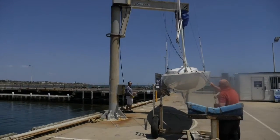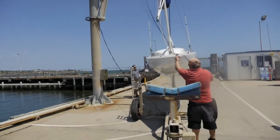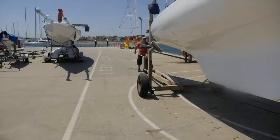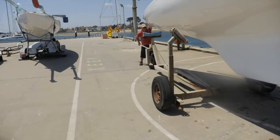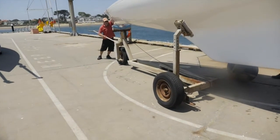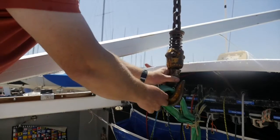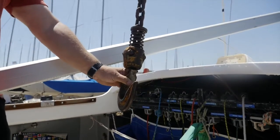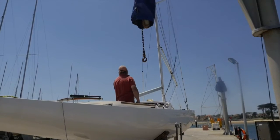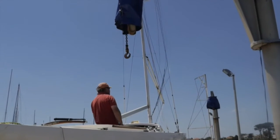Release the load. After you complete your lift, release the crane, slowly transferring the load of your object from the crane to the supporting structure or ground, such as your trolley. Remember, forces from the impact of a moving object can be much greater than the force of a dead weight alone. Slow and gentle is a good rule of thumb. Once the load is released, remove the lifting strops and the hook from the attachment points. Do not stand under or allow others to work under a load until the load has come to a complete rest on its supports, trolley or boat cradle.